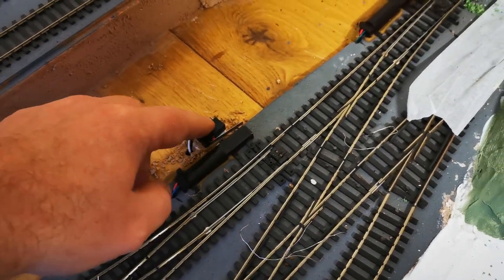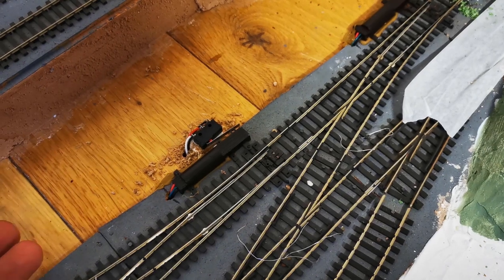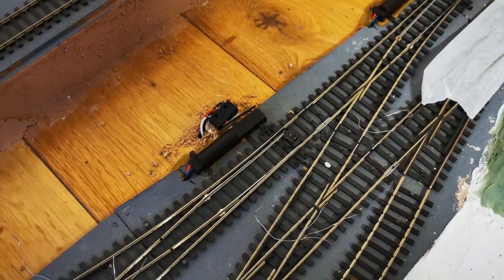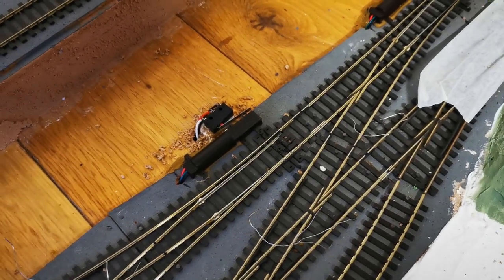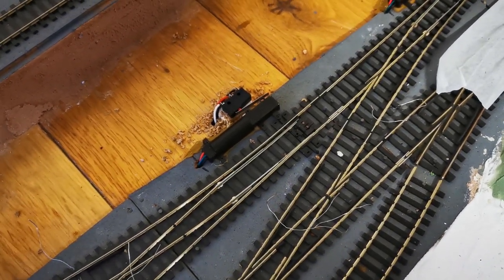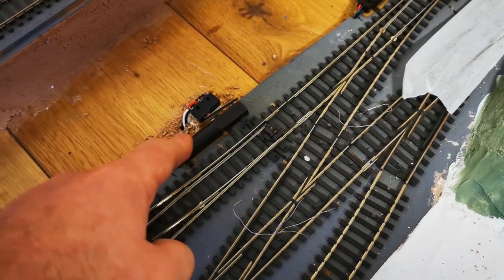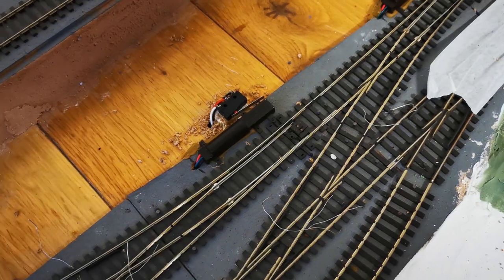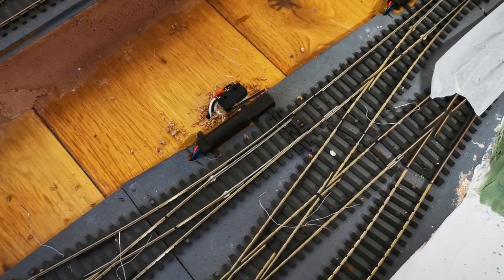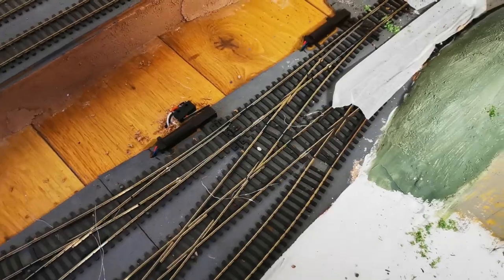I put a feedback micro switch in, which has got three cables coming out feeding into the Arduino, giving two pins an input to say what position the turnout was in. I was feeding that back to JMRI using the feedback part of the loop. But the JMRI feedback still couldn't get to work properly — sometimes the turnouts wouldn't work, sometimes it held relays on or chattered them, and at one point it held on long enough to burn out this PL11. The PL11 is a lot more expensive than servos, and with three wires plus three feedback wires, that's six wires per turnout.